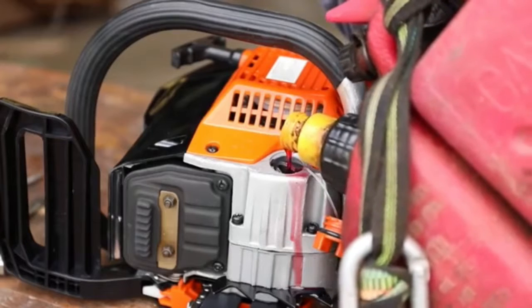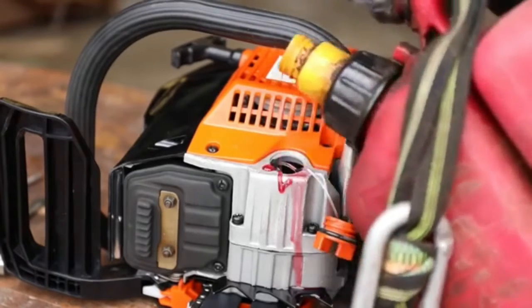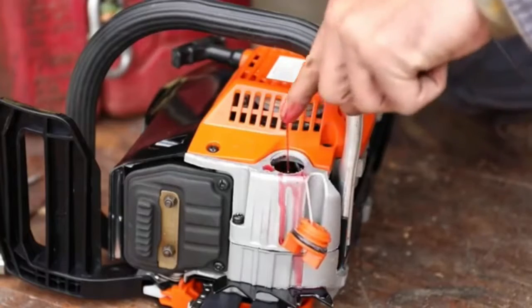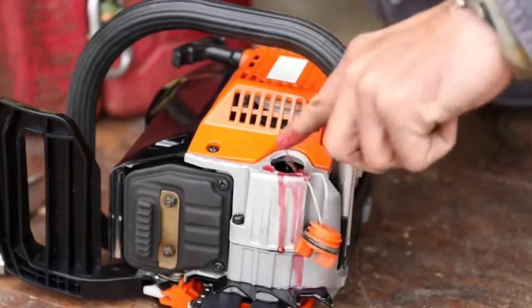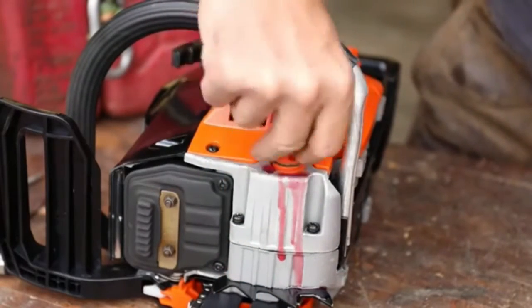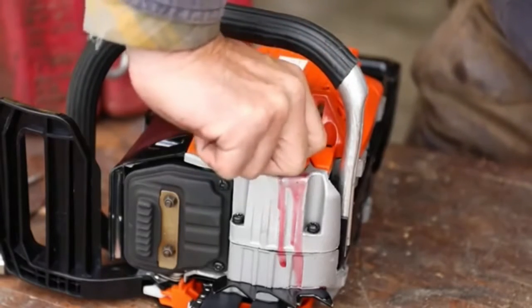Can I just run used motor oil or clean motor oil because it's cheaper than bar oil? Well, of course you can — it's better than nothing. But I wouldn't recommend used motor oil because it has so many contaminants that it can wear things out and clog your oiler. That's a big oil tank for such a small saw. New 10W-40 would be better. The issue is the stickiness — look how stringy bar oil is. That's so it sticks onto the bar instead of being flung off the end.